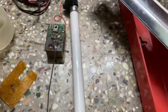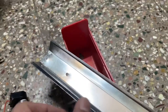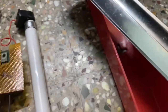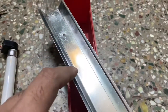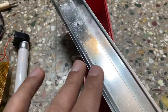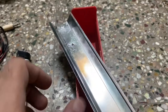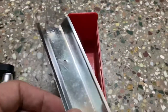We are replacing the old CFL components — they're of no further use. The aluminium plate which was used as a heat sink will now have LED strips mounted on it, and it will still act as a heat sink. There will be a separate circuitry for charging the lithium-ion battery and a switch embedded in the cabinet, along with any required drilling.